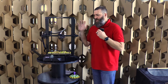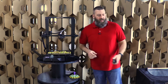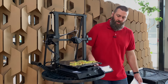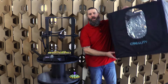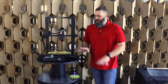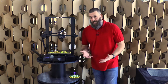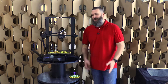If you take that out, the CR10 Smart is really just kind of a CR6 in a CR10 sized frame. And honestly, that's not a bad thing. Sort of related to that is the idea of the integrated electronics down here on the bottom. I personally like having enclosures around my machine whenever possible so that I can print other materials and not have to worry about drafts. If you have integrated electronics into the machine itself — your control board, everything else inside of here — those are generating heat and they can overheat. If you put them in an enclosure to keep the heat in, you don't want that heat near your electronics. So that can be a bit of an issue.